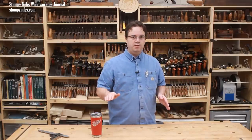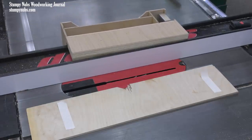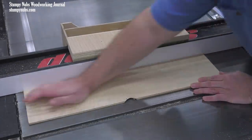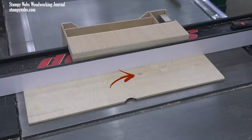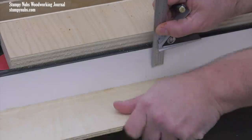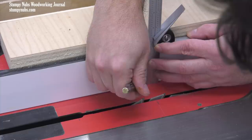If you like that way of locating the center, you can do it even if you aren't installing a new insert. Lock your rip fence a couple inches from the blade, then clamp or use double-sided tape to attach a piece of wood over the blade slot. Now slowly raise the spinning blade until it begins to emerge, then use a square to carry that point over to your fence and across its face.